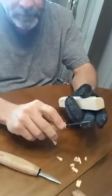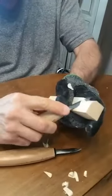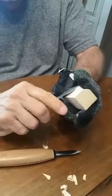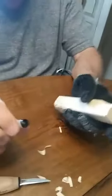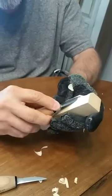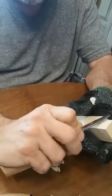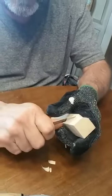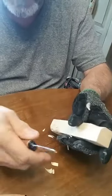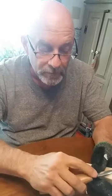The second knife we talked about — I think you call it a spear point — has the same flexible blade and it's two inches. What I like about it is if I'm setting a face... I can take this blade and even though it's a long blade, I can just use the tip and come right up through here and just take a little scooping cut, but I don't have to worry about dragging the whole blade across the face. Some friends that have bought these knives, especially those used to carving with curved blade knives, use them a lot just because they like the long reach with this blade. That's the number two, and it's flexible.